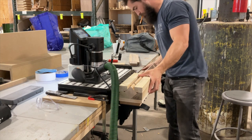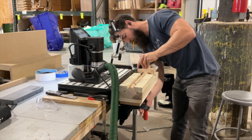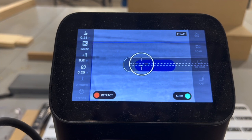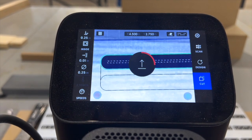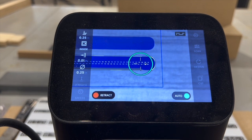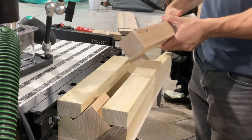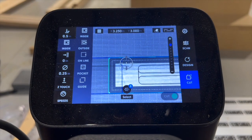Now comes the complicated part — this mortise. I made a jig from 45-degree pieces to hold the leg on its peak; that took about half a day to make, but accuracy is really key. I start cutting the mortises on either side of the arris — the exterior part of the joint first. I cut both sides all the way down in quarter-inch increments, all the way to one and a half inches deep. Once those are clean, I flip it 180 degrees, reinsert it into the jig, and start cutting the interior portion of the joint.